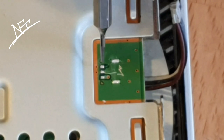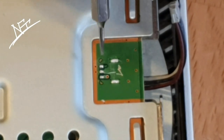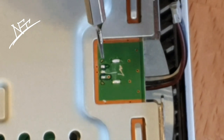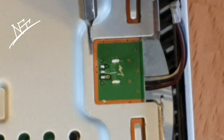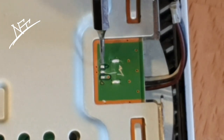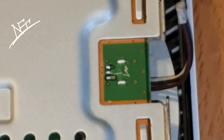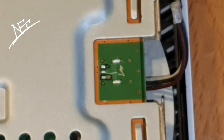On the right side you can see the contact for PWM, which controls the fan speed. Here also it's the same thing — you need to take care that you do not solder these contacts together, because each contact is a single contact. This is very important. If you want to try to fix that, the first thing you need is some soldering skills, and you should have a calm hand. Of course, you need time and patience.